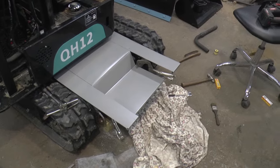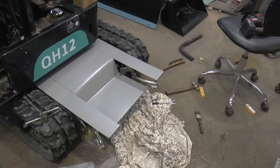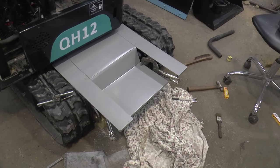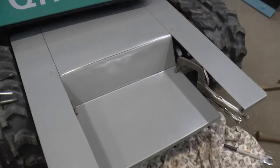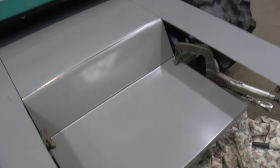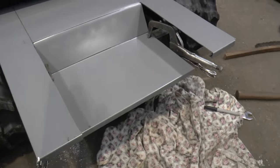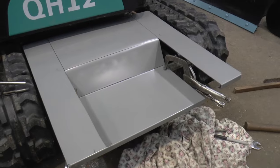Working on the shield for the hoses. This is another dumpster find — it's not sheet metal and it's not steel plate, it's kind of in between, almost like this stuff. Not easy to work with — it's too tough for my brake, so I gotta bend it by hand. I just got it mocked up here, I think it's gonna be okay. These sides will bend down and then I'll weld it along here, and of course this extra stuff will all be cut off. I just thought I'd show you the process of what I'm going through to make it. I think it's 15 inches wide — that pretty much covers the hoses. You'll understand it when I get it done.